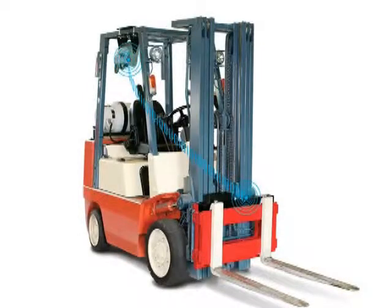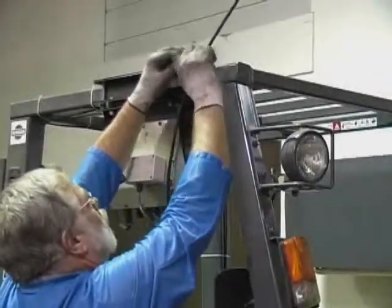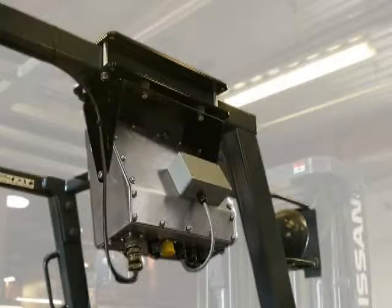CLS compatible indicators can accept data wirelessly from the 2-channel digital iCube junction box located on the scale carriage. Or if you choose, the wired version communicates weight data via the coil cable provided with the scale. For wireless versions, the communications electronics are protected in enclosures mounted on the back of the indicator and in the junction box.